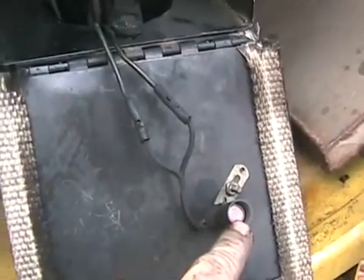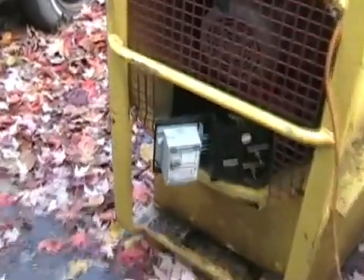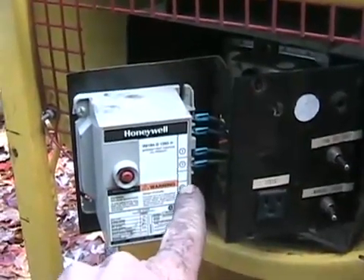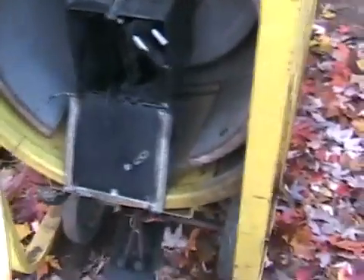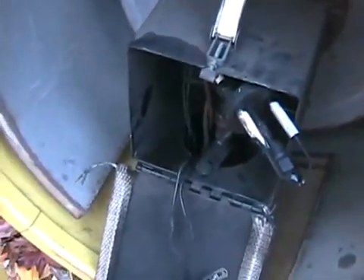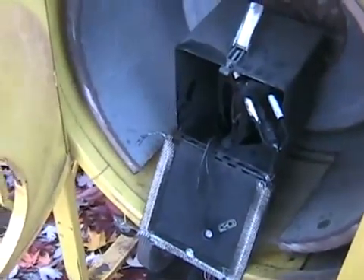And we have a photovoltaic cell — this cell senses light, and I'll explain how that works in a moment. On the business end of the unit where all the power comes in, you've got your little brain box, and that's a reset button. The signal from your photovoltaic cell comes here, and the signal from that heat-sensitive switch — the safety thermostat — comes here. When you first turn this thing on, there's no light in the firebox, so that sensor senses darkness. That little brain box has to first sense that it's dark in the combustion chamber. If it doesn't sense darkness first, it knows the door is open and it's sensing light from outside, so it won't allow it to fire up — because you could get a blast of fire in your face.